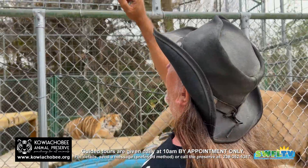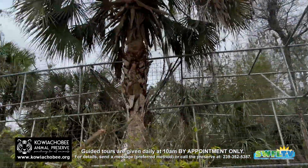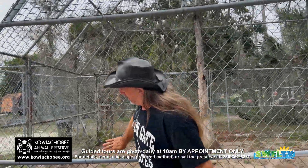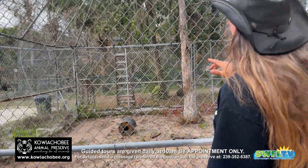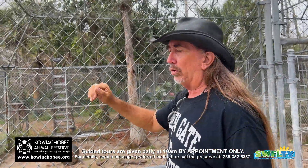Why stronger? Because Florida has hurricanes. We're also putting a lid on. This one already has a lid, but we want to strengthen all these. What we actually do is add uprights, push them down to the ground, and we're going to cap the footer with concrete, so it'll be nice and strong. Wherever it might fall, it's going to push back up. Any kind of rust damage we will replace, and anything that's just worn but not rusted through, we'll sand it down and do some painting.